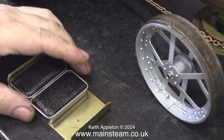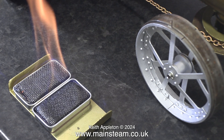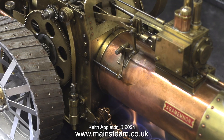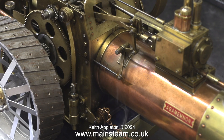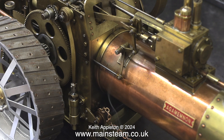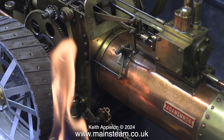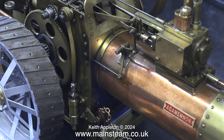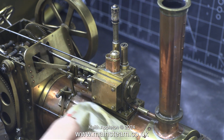By this time the spirit burners had run out of methylated spirit, so I removed the assembly from underneath the firebox, refilled them with methylated spirit, cleaned up all the mess, and relit them. This time the flames looked a lot better than they did originally. I have a sneaking feeling that because this traction engine has been run on compressed air, some oil in the firebox may have run down onto the burners - but I don't really care because the fire is now much better.